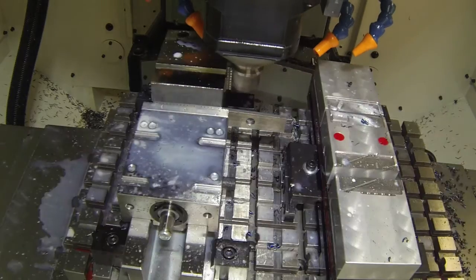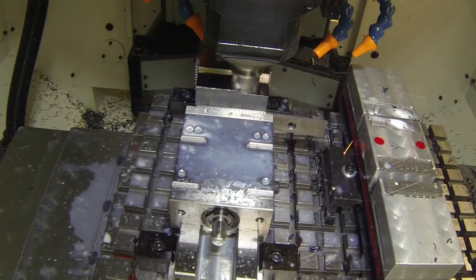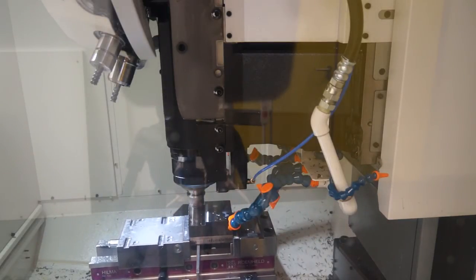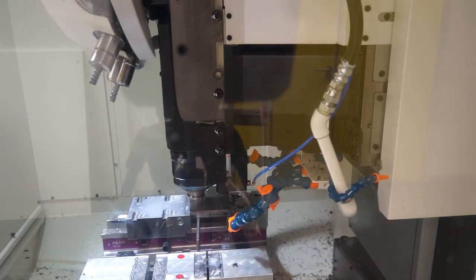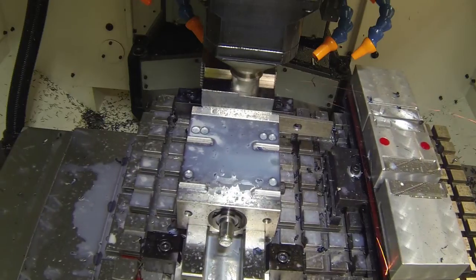Could be a consideration. Where we would probably fall back on the BT40 is we wouldn't be using things like 150mm face mills. But when it comes to face mills under 80mm diameter, the machine will be able to run at the same cutting data that BT40s can. Is there anything we can quantify for viewers — drill diameters, depths, face mill diameters and depths of cut? For example, in EN8 we can drill using a 40mm U-drill at the cutting speeds recommended by the cutting tool.